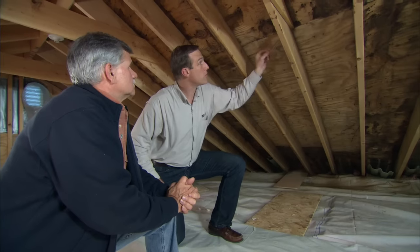The mold's all gone. There's a little more blasting to do, but when finished, everything up here — the rafters and the sheathing — will be coated with a mold-inhibiting coating, just to be sure, in case there are any roots or any mold that might have been missed, so it won't grow back again.